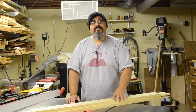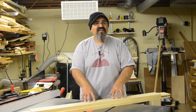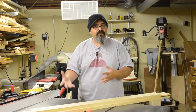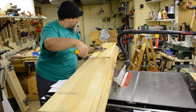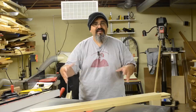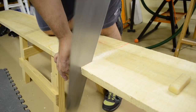So I really didn't see why I should spend extra money on maple when I could get the same thing done with poplar and save myself a few extra dollars. Let's jump right in and start talking about the construction of this undercarriage area — really, when it comes down to it, it's just a frame. The first thing I did was mill up my rough stock. I like to do mine to rough length with a little extra, then cross-cut it closer to the size of the components, which works better with my machinery.